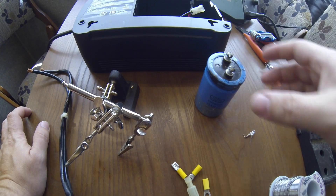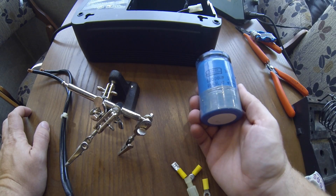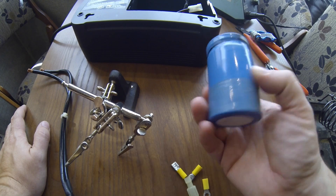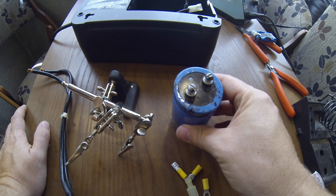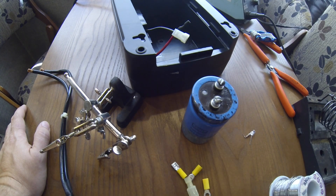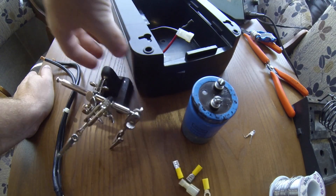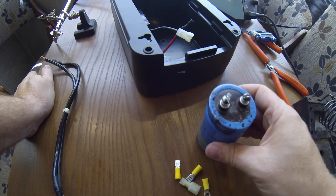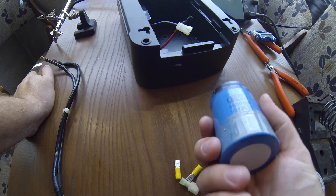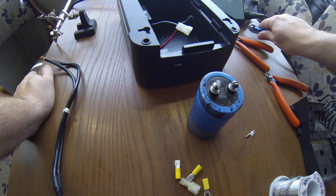I'm going to do one more little mod to this box. The only thing we really did to this UPS is remove the speaker, but I'm going to add this capacitor — a 60 millifarad, 15 volt DC capacitor that I've been using for a while. I'm going to put it inside this case to stabilize my voltage. What's happening is over my long run, the voltage drop is dropping to 11 volts, and this UPS is saying the battery is dead when there's really nothing wrong — it's just a little bit of voltage drop. It does it when it does its little self-test and kicks into low battery mode. So I'm putting this in to stabilize the voltage, giving it a little bit of discharge capability so it fools the UPS into thinking there's nothing wrong — because there really isn't.